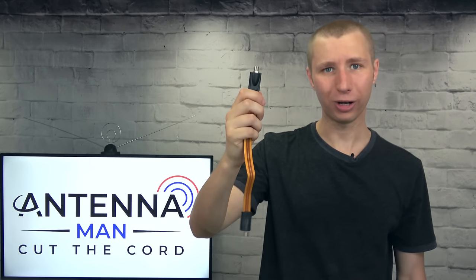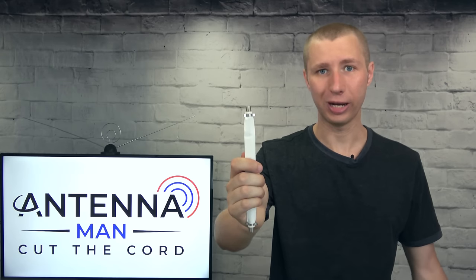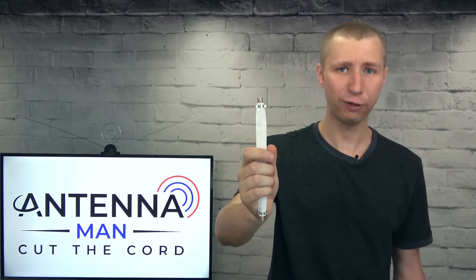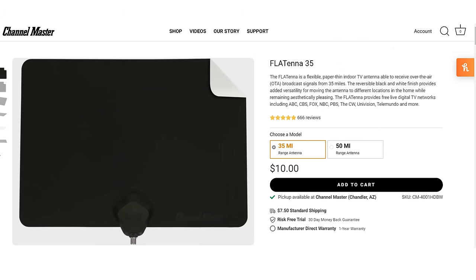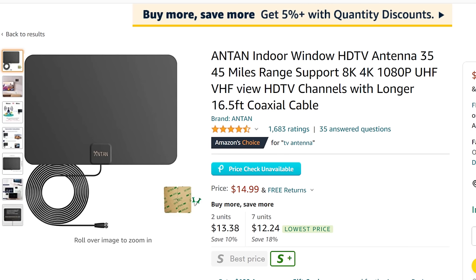It's not to say the other one won't work — it just won't work as well if you have a marginal TV signal. This flat coaxial cable would be perfect if you're trying to connect an outdoor antenna but don't quite have the skill to drill a hole in your home or run the coaxial cable through your wall. It's also great if you live in an apartment complex and want to hang a flat antenna outside your window, especially if you live in a brick or metal building. If you're in this situation, look at either the Mohu Leaf or Channel Master flat antenna. Both allow you to connect an external coaxial cable. If you use a thick quality RG6 quad shield cable with a flat cable like I did in this video, you may significantly improve your reception compared to one of those generic cables that comes with the antenna, or even worse, one of the hair-thin coaxial cables on the generic flat antennas listed on Amazon.